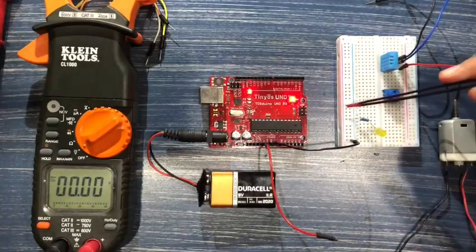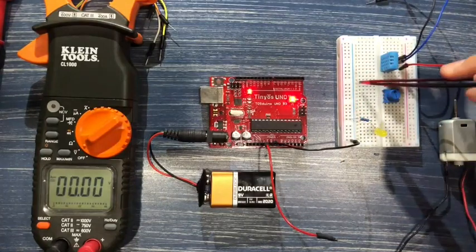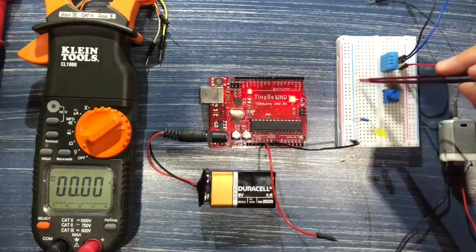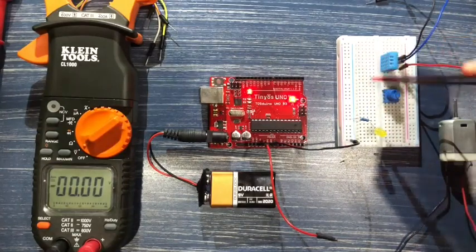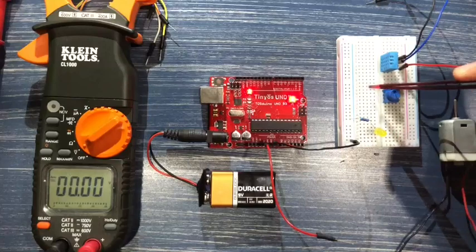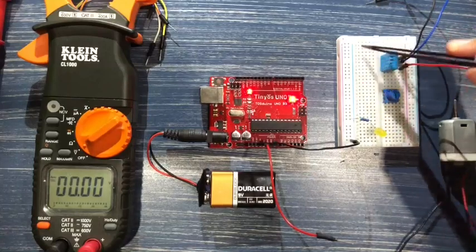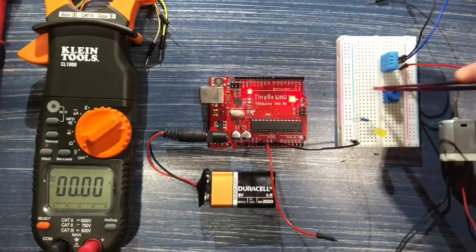And the way you do this is you bring 5 volts positive and ground negative to your components on these rows right here. Now, everything on one single row, every pin on one single row is connected. And these are numbered 1 all the way down to 30 on this particular breadboard. And if we take number 14 here, this pin 14 is connected to this pin 14, and this one, and this one, and this one. So you have letters up here denoting the columns. So A14 is connected to B14 is connected to C14, all the 14s are connected.